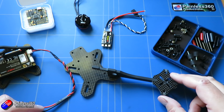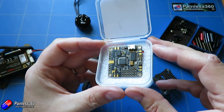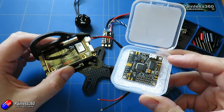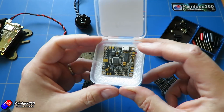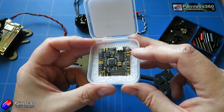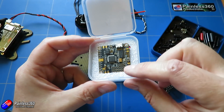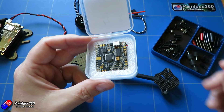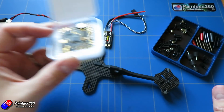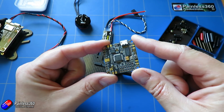With the signal wires there are a couple of things to think about. I'm going to need a spare UART to connect the wires from the Connex to, because the Connex will provide some telemetry information on its on-screen display and I'll need a hardware UART to do that. I need to figure that out when we plug it into the computer. We're also going to potentially connect the buzzer, some external LEDs, and our receiver — we're going to use the XM Plus, an SBUS receiver that's going to connect to the pins here. So now we know what we're going to do — let's plug this into the computer and see how it's configured.